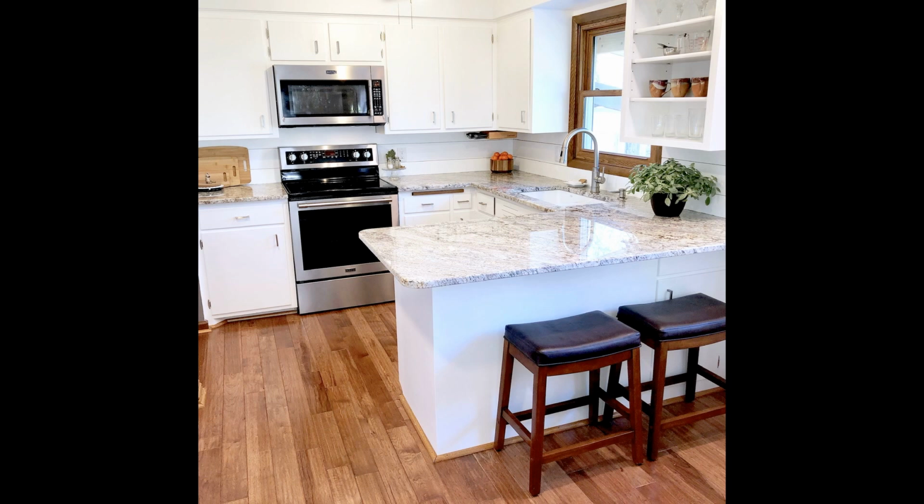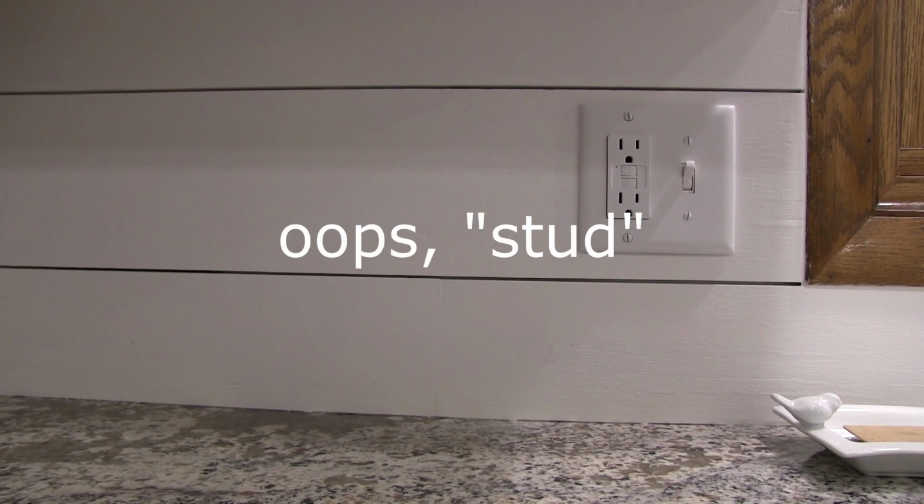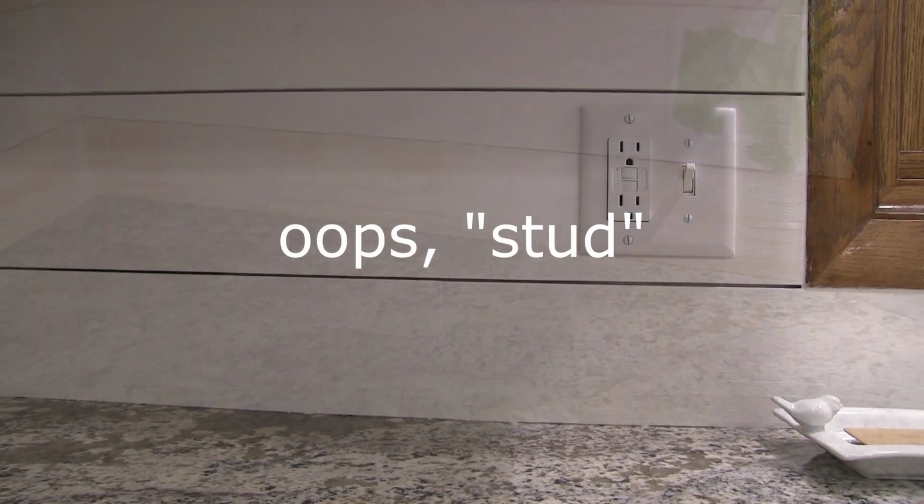Another question I get is, what if my wall is more than 8 feet long? The plywood planks are 8 feet long. Well, you can stagger them, and just be sure when you stagger them that the ends butt up on a joist. And you can just do it random.